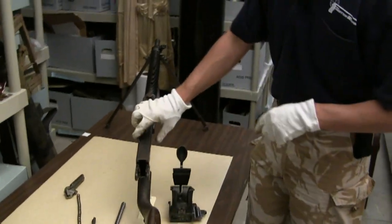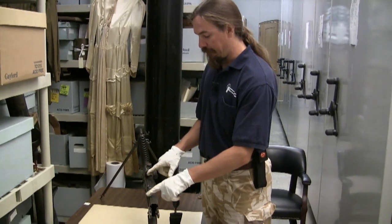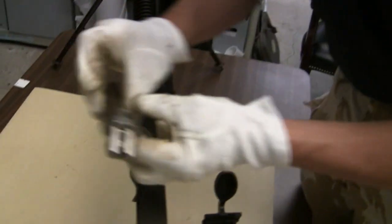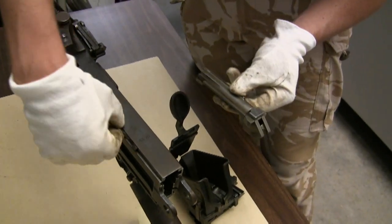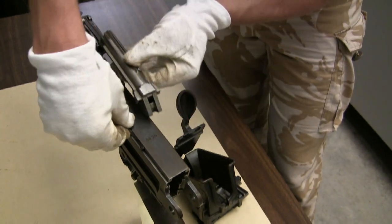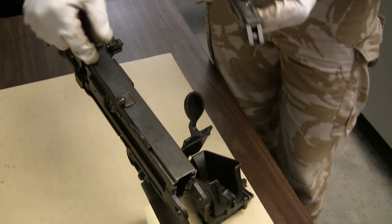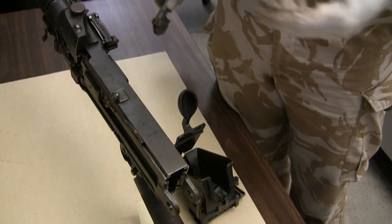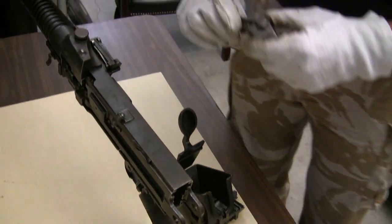One last thing to point out — and the Japanese did this on the Nambu series of machine guns, the Type 96 and the 99 as well as the Type 11: this big lever here is actually the ejector. It runs on a cam in the bolt, so there's positive force on the ejector when the bolt is at the proper position back — the ejector is cammed up and this big hammer-finger smacks cartridges out of the action. Not fragile, reliable, really pretty cool, and it makes for an interesting thing to watch when the gun is shooting, because it's woodpeckering back and forth.